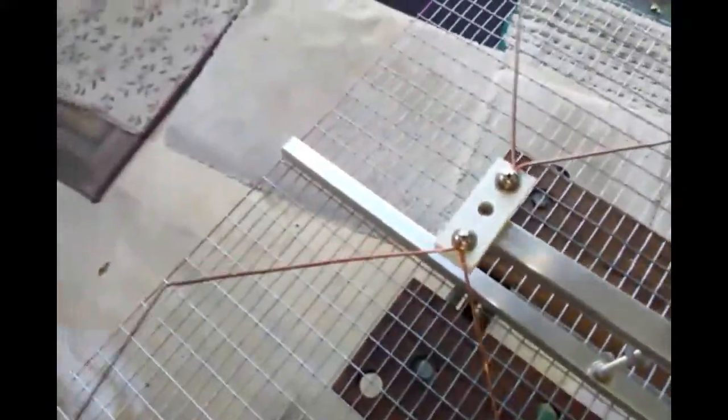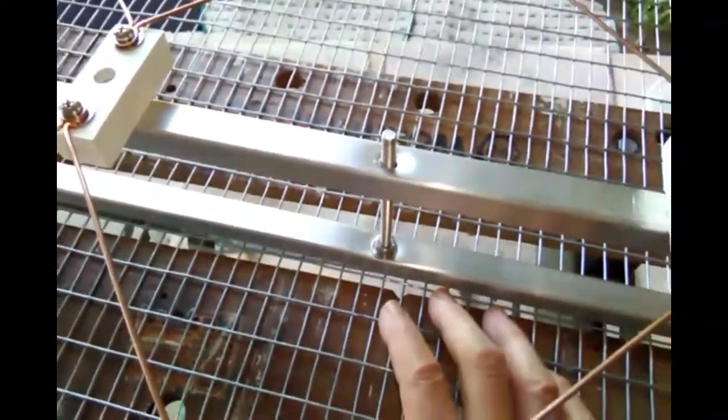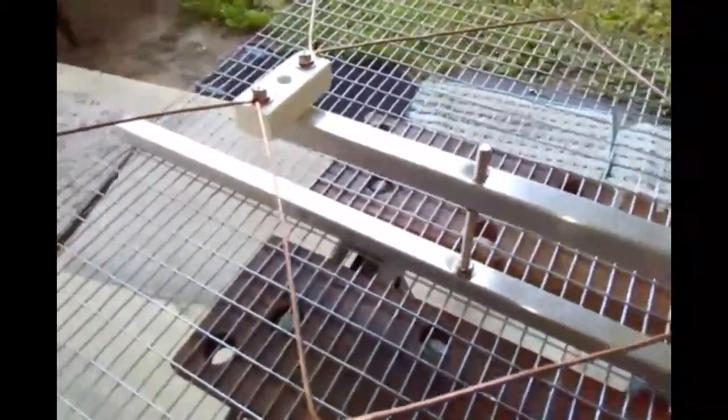This is the gray Hoverman element we worked on — we're going to put this on here and sort of set that in place. The reflector is kind of universal. I use these long threaded stainless steel bolts so I can adjust. On a bow tie antenna I want five inches between the grid and the elements; on this gray Hoverman I want four and a half inches. So this is adjustable — I can build any element or array I want, as long as the holes line up and it fits. Now I'm going to put a flat washer, a lock washer, and a nut on there and adjust it.